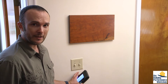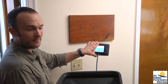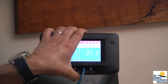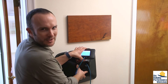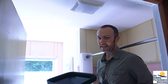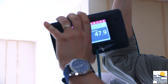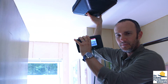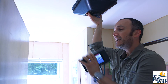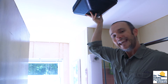For spaces that don't have a door, like wall cavities, use your pressure pan. Anything totally inside the house reads zero. This interior wall reads 31 out of 50 — about 62% outside — connected to attic and crawl space. We've just verified this wall cavity has leakage. As trivia: the pressure pan over an exhaust fan should show close to 50 pascals, and this one does — that tells you it's ducted to outdoors, not just to the attic. If it showed the attic number, it's ducted into the attic; if zero, it's not ducted at all.